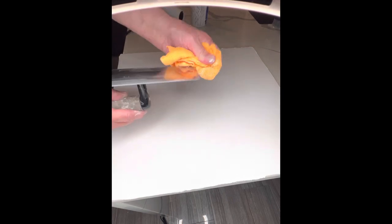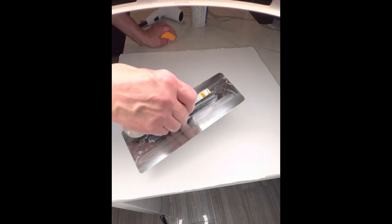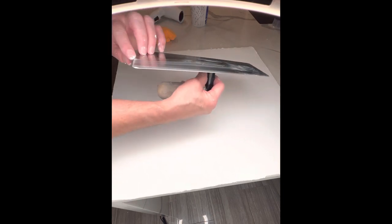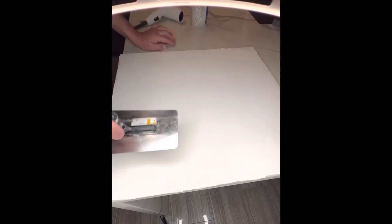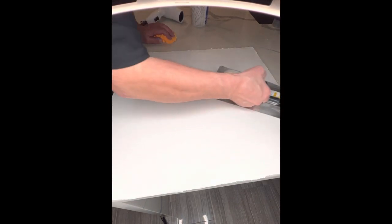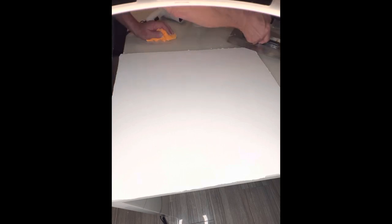It's very damp still. Clean my trowel — do it right — make sure it's a thorough clean. We're using a grain material so a thorough clean for a grain material. Don't worry about these little barnacles because sand — that's what made your material. Now here's the part I love about marmorino 600 and the combi trowel: that beveled edge. When we have it up at a little angle we're actually very flat — because of that bevel it's like this mini compression. So we're going to compress this material, compacting the grains, what we would call closing off the pore.